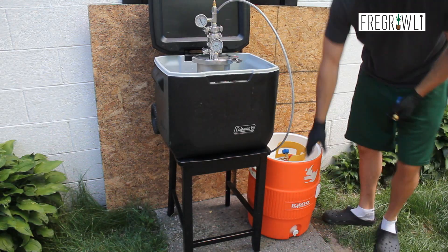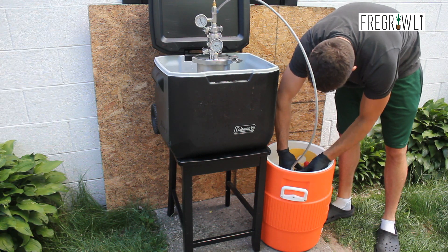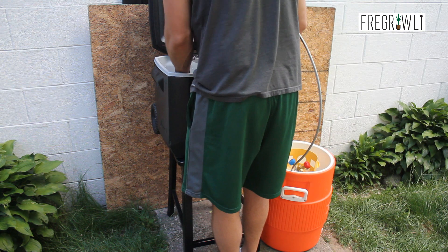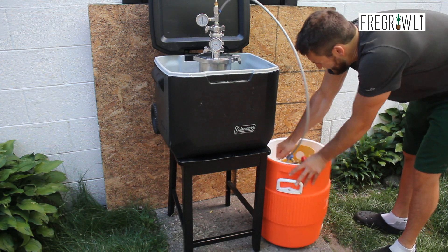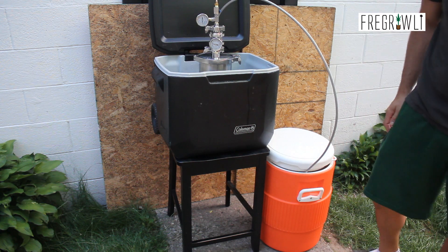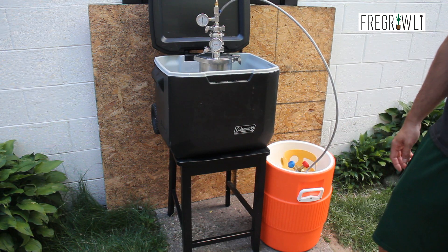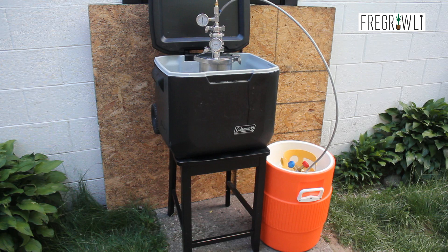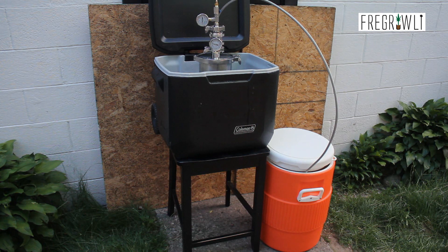Using the extra gauge I purchased and explained in previous videos, I can check the pressure of both my recovery tank and my distillation chamber. While mostly unnecessary, I get curious and would rather be safe than sorry. Another tip I picked up from fellow extractors is to periodically shake your cooler that contains the recovery tank and dry ice — this will help condense the solvent into a liquid quicker and keep the tank cold. You should also know that air is dry ice's kryptonite; store in airtight coolers and use towels and lids to keep air out. A sight glass on your collection base will allow you to know exactly when recovery is done and when to close the valves. Unfortunately, my system does not yet have one, so I had to guess and basically just weigh it by hand.